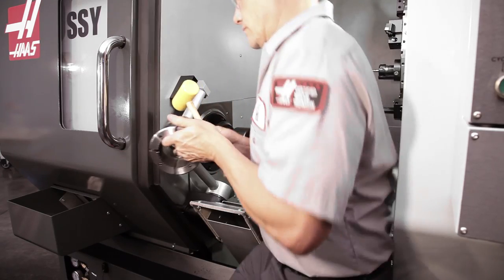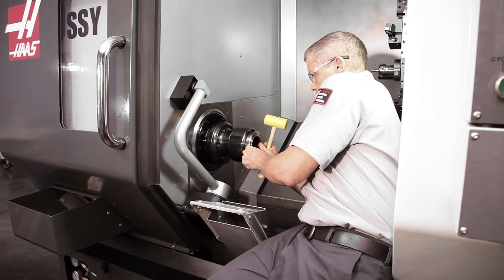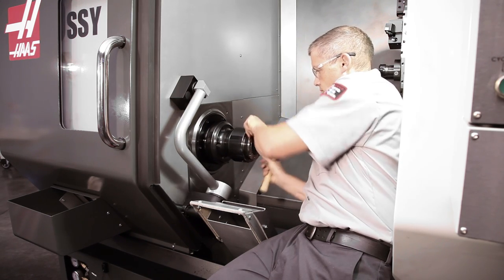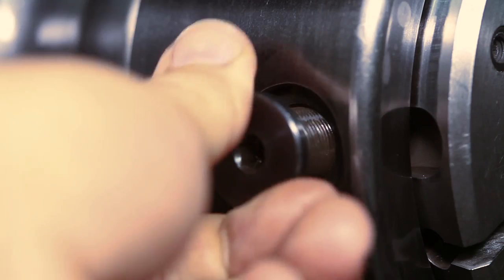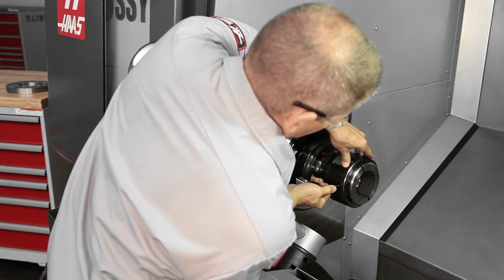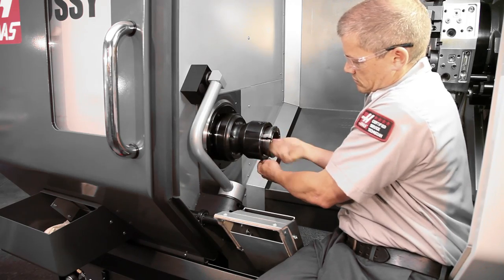Actuate the clamping circuit again to bring the draw tube to the unclamped position. Insert the collet into the chuck body — it is a tight and accurate fit and may hang up slightly. A few small taps with a light mallet will generally align it so it will fall into place. For this unit, rotate the collet counterclockwise to engage the draw nut threads and bring it towards the chuck body. Don't forget to install the anti-rotation screw in the collet chuck body — with the collet slot aligned with the screw hole, thread in the anti-rotation screw and tighten it. Refer to the collet documentation regarding the proper adjustments for gripping your material. Removing the collet chuck is simply a reversal of the installation steps.